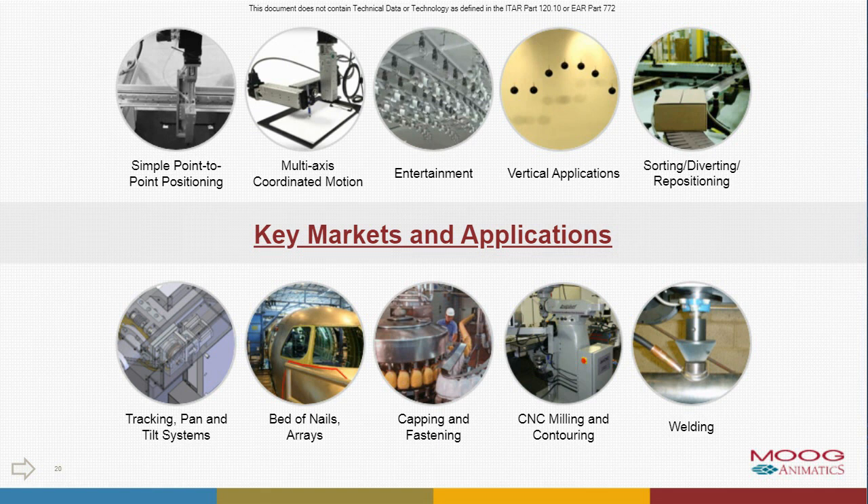Tracking, pan and tilt applications — some of these are known as azimuth elevation (ASL) controls for military and similar uses. A lot of the tracking aspects may be tracking facial recognition on people in an airport, for example. We have a lot of handoffs on position controls from one motor set to another on pan and tilt controls and security issues, where they have to literally track from one set of pan and tilt motors to the next set and pass off those positions. Additionally, for tracking sunlight for an ASL control or pan tilt control for solar installations, the sensors can go directly into the motors. The motors can sense the light difference and center azimuth-elevation control on the sunlight source as it moves across the sky from morning to evening — so you don't need an external controller to do that.